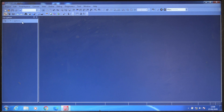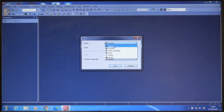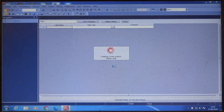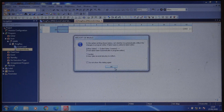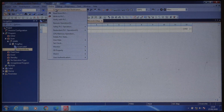Now that GX Works 3 is loaded up, the first thing we're going to do is start a new project — it's a new PLC. My PLC is currently in stop mode. You select what CPU you're using; there are all of them in there. I'm using FX5 so I'll select FX5. For the program type I'm using ladder as always, then I create the project and it will throw a couple of messages — you can read them if you want. From there you can establish a connection by going online.